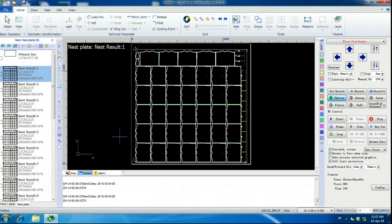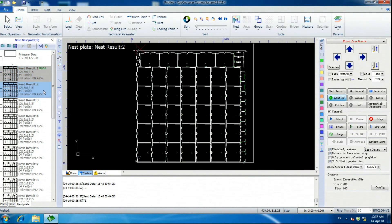We've just finished cutting our first sheet. We've reloaded the machine with a new sheet and set its location using the remote control. This is very important to remember to do every time: click to the next sheet. If you're not sure if you've already done this, go ahead and click to the next one — if it stays white, it hasn't been done yet.